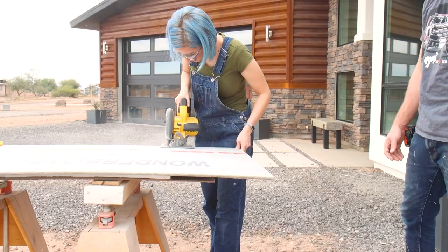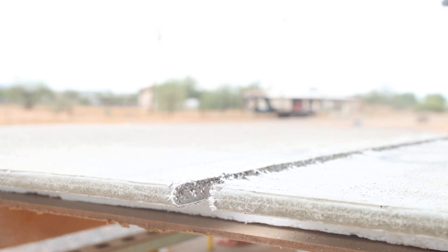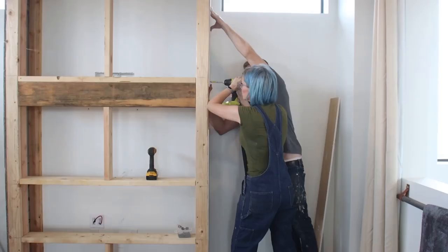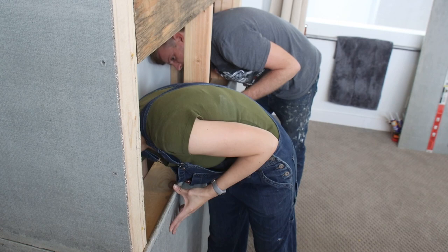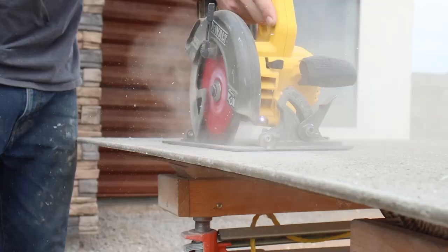There are a couple different types of cement board and they can be cut using a variety of tools. We found the easiest way was to use a special masonry blade and a standard circular saw. Cutting masonry is super messy, so it's something you'll want to do outside and you should probably be wearing a mask. To secure the cement board to our wood framing, we used special wood-masonry combination screws, attaching it similar to hanging drywall. We made sure to sink the screw heads all the way within the cement board and tried not to crack it. To account for the electric fireplace opening, we moved the cement board into place on the face of the fireplace and traced around the framing using a pencil, then cut out the opening outside. The cement board gave us a nice base layer for our decorative panels and also added significant rigidity to the framing.